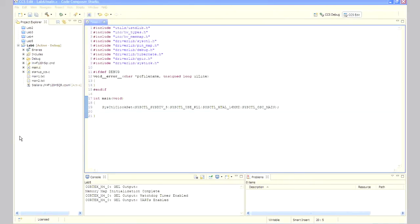In Step 7, we're going to use the green LED. Remember, 2 equals red, that's pin 1. 4 equals blue, that's pin 2. 8 equals green, that's pin 3. So we're going to use the green LED as an indicator that the device is in hibernation. The LED will be off for hibernate and on for wake.